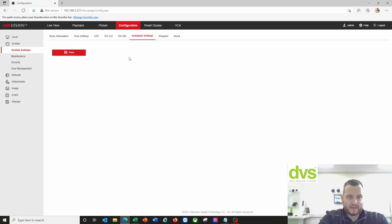Okay, so configuration, we've done that. Metadata settings, road traffic is enabled, and click save. Wiegand, you can enable it if you want, and you've got Hikvision 34-bit, 72-bit, 26-bit, depending on the system you're using. That's where you select your output. I'm not going to use Wiegand, so I'm going to disable it and click save. Don't need it because it's not connected to anything. Okie dokie.